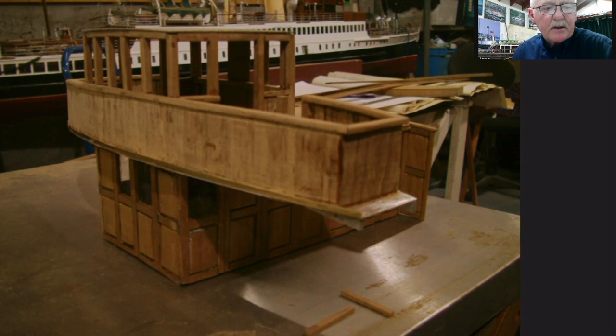Could I get a fair and pleasing hull in metal? I googled aluminium and epoxy and also looked into welding. Aluminium can be glued with epoxy resin if you first clean off the invisible oxide which forms on the surface. I tried welding, but with the low melting point, it simply melted rather than joined.